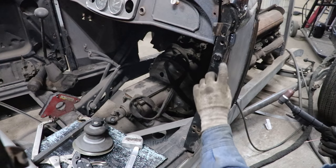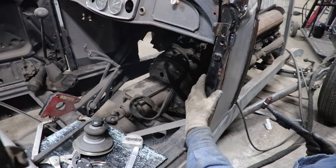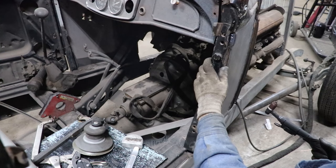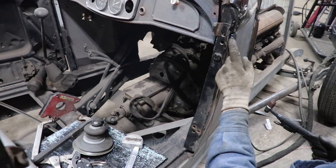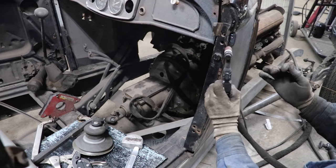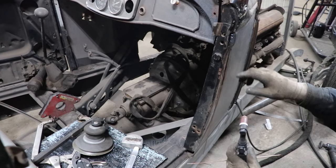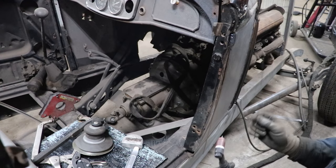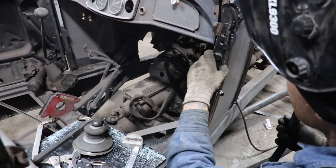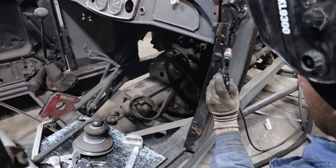What I'm doing here is I've got a piece of 3/32" filler rod — I don't like to go much more than that when fixing a seam like this. If it's bigger than a normal piece of filler rod you're probably getting a little big and should make a patch panel. With this it fits perfectly in my gap, which makes it a lot nicer. I'm working down the seam trying to blend it all in — I got it all glued in up where the door hinge goes, and as I work down I'm basically weaving the torch back and forth and melting the filler rod into the seam. It glues everything together and makes it fairly flush when it's done. The hardest part was right here in this corner getting into the door jamb. I keep an extra piece of filler rod just in case it looks like it's getting hot and going to melt away — I can add that to help me.